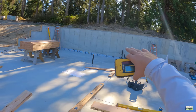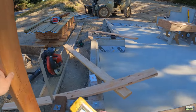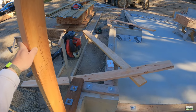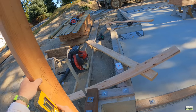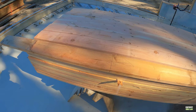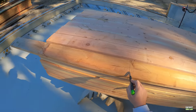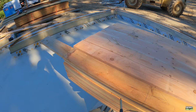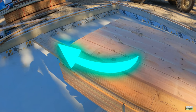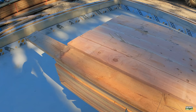On this house we have eight foot walls. We're going to build pony walls, but our height is a hundred percent dependent on our garage door height. I've gone around to all the corners, shot and marked with my laser — that's the control point. But I need to get my wall height at the garage opening, so I need a control point there. Then I went through and story pulled it. That line is at every single corner of the house, shot with a laser. When I held that stud in place at the garage opening, the left-hand side of the stud was sitting on the concrete, and that's where I want to measure my garage door opening from — that determines the height of my pony walls for the rest of the house.